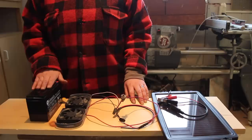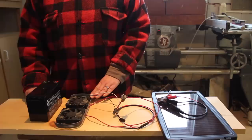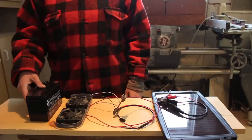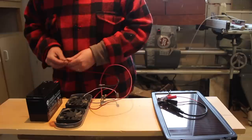We'll be running the pop can heater off of a simple 12 volt system. We've used a solar panel this size with a fan this size to run a pop can heater before, so we know it works. This solar panel on its own should run the fan when it's in direct sunlight. However, the pop can heater will also work in partial sun where the panel might not get enough juice to run the fan, which is why we have a 12 volt battery as well. We'll connect both the fan and the solar panel to the 12 volt battery to run the system.